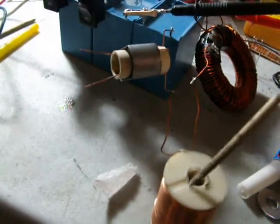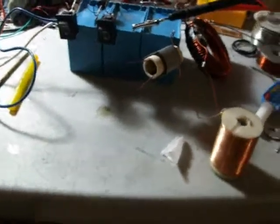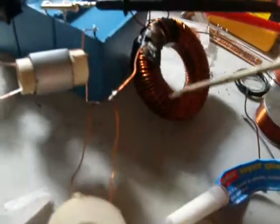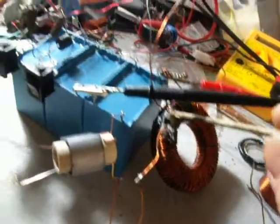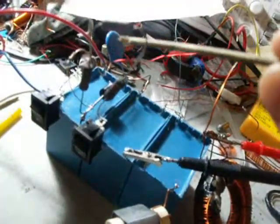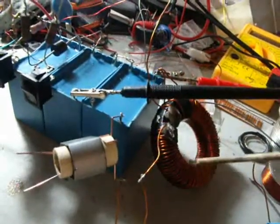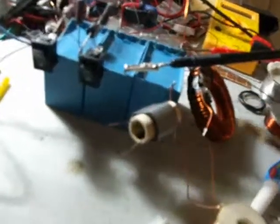I prolonged the pulse to increase the chance that the plasma will be taped on camera. This is a triggering transformer — two wires connected to this cap, to this little cap, and a lot of turns around it to increase the voltage temporarily between the electrodes, so to make a spark gap which will trigger the thing.